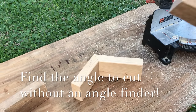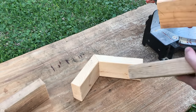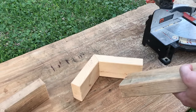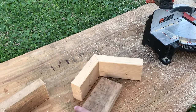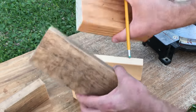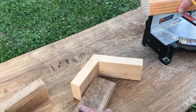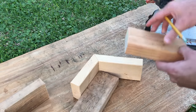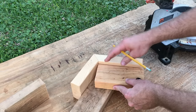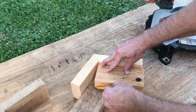I got a 110 degree angle right here — these are props I used from my previous video. Let's say I don't have an angle finder, or my angle finder breaks while I'm on the job. To find that angle, make sure both of your pieces of wood are the same thickness and same size. These are both two-by-fours. Put one piece like this, put the other piece on this wall so each piece is on the wall like so, and you mark right here.